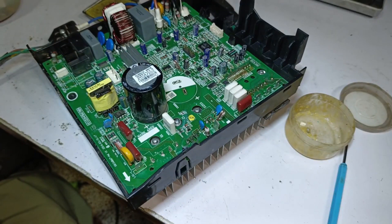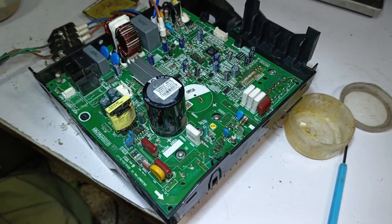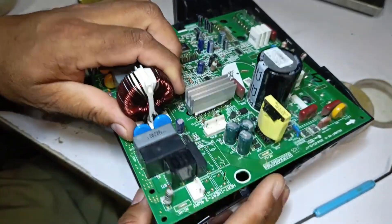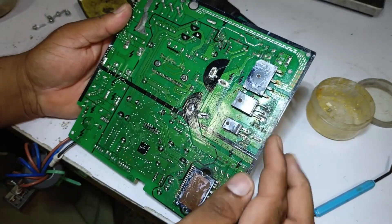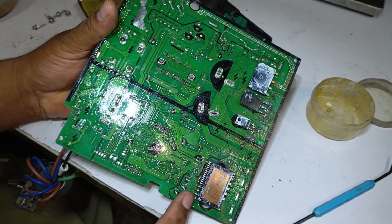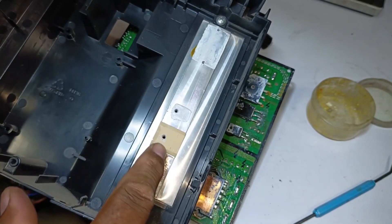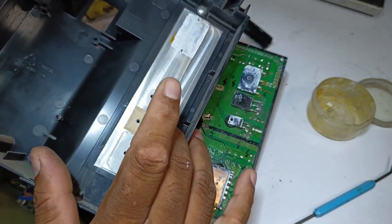Never test this in this position — I have already experienced this issue before. We will first disassemble it and take this circuit out of its cover again. I removed it for a reason: sometimes when you solder, the soldering points can accidentally connect to the back, or the solder might flow downwards. If your soldering point becomes too long or you've applied too much heat, it can connect with the heatsink. If it connects to the heatsink, a short circuit is inevitable, and your work will fail again.